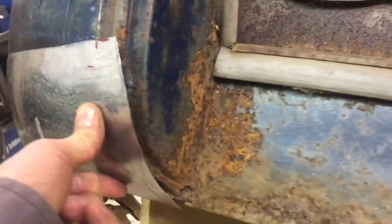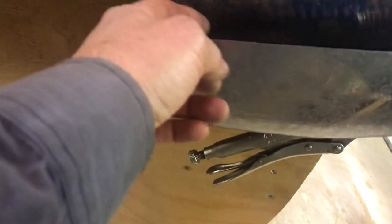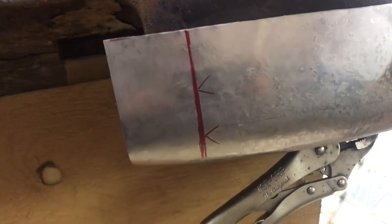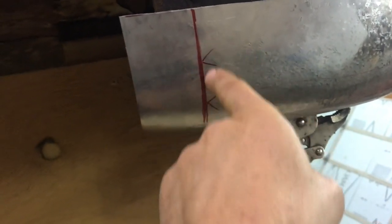I just pressed this up tight against the cab, and I took this little screwdriver and I scribed along this edge here. So I think there's a pretty good mark in there now. And on the back here, I got to put this little step here. I just kind of eyeballed it, but I think that's probably square there. Yeah, so here, I just used a square, because this line is 90 degrees to this line. I just marked where I want it with these little V marks.